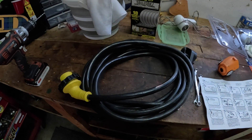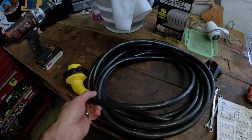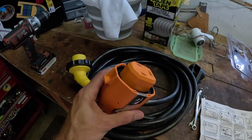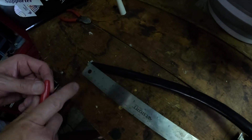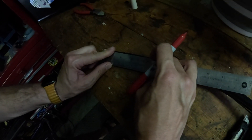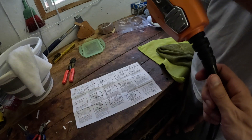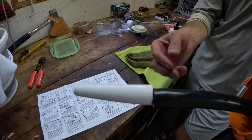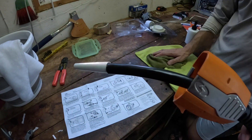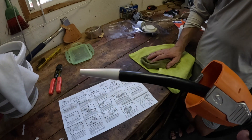The one thing with these smart plugs is that you do need a different end. You can buy the smart plug with this end kit, which means we need to take our old cable, cut off the old twist lock, and replace it with the new smart plug. We've cut off the old twist lock and now we're going to strip the wire back — it does give you an exact measurement for how far to strip the wire, which is convenient. They give you this cord install tool — basically a little plastic cone. You slide that over the end of your cable, lubricate it really well with dish soap, and then push the cord through the end of the seal until you've got enough slack to do your wiring.